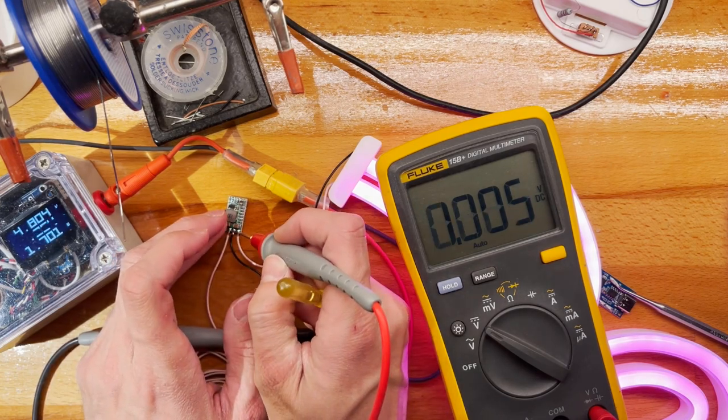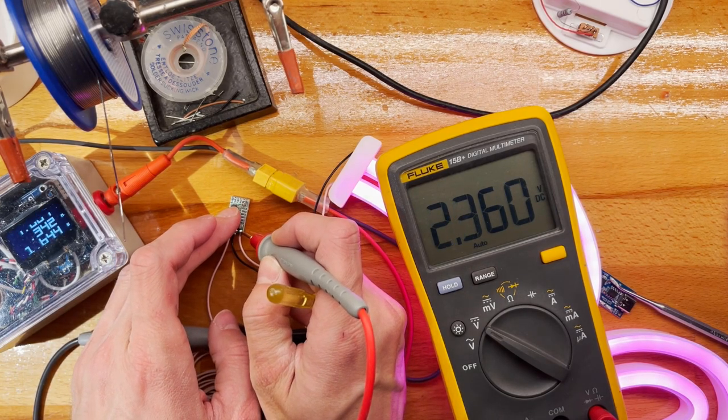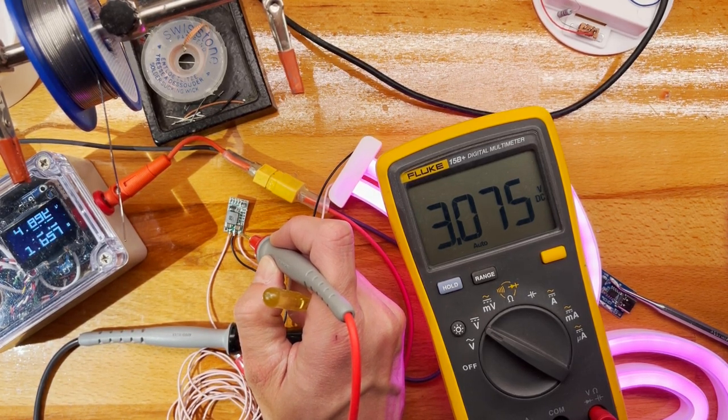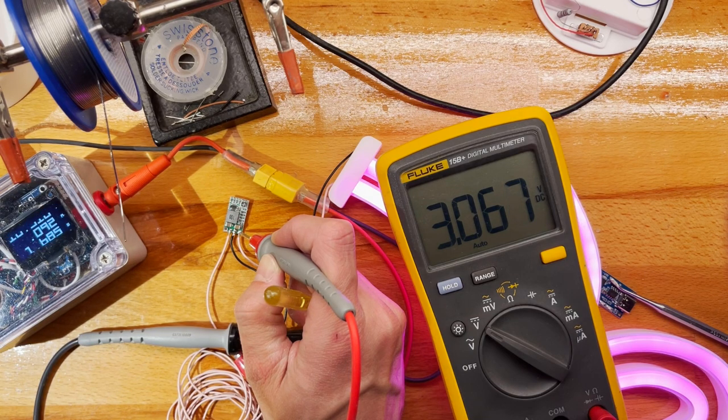Okay, so now it's set at 3 volts. And I think it just refuses to play under. Okay, so you can see the buck working. So we're feeding in 10 volts, 15 volts, 20 volts, and it's still outputting a rock solid 3.0. And its efficiency is also pretty good. You can see the watt figure is fluctuating only slightly.